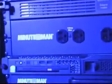The other UPS is called an online UPS. This is also referred to as a double conversion, and the reason for that is it takes the AC power coming out of the wall, converts it to DC, and back to AC on the output side. It provides by far the cleanest and best power protection that you can get on the market. It is an ideal solution for a manufacturing facility with a lot of machinery running, and wherever you have generators, this is an ideal unit to use.